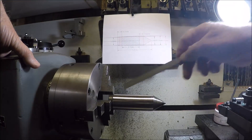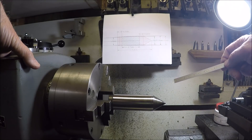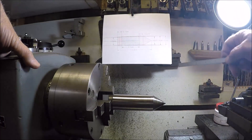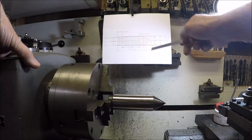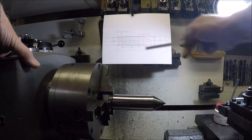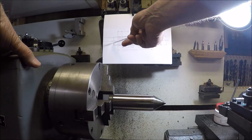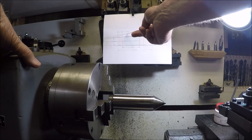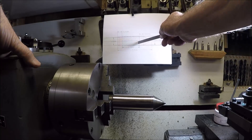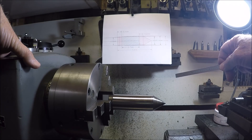I'm going to take this part out and move it over to the Monarch. Since I have a straight shaft right now I can hold it in the six-jaw chuck, turn that tail piece down, and make the starting point for the taper. Then it'll be ready to cut the taper. I'll go shy of my drawing and start test fitting from there. Hopefully be successful. I've been having a lot of fun with this build. This is going to be part one - we're going to end here. The hard turning was definitely an adventure.